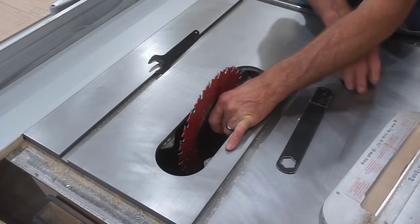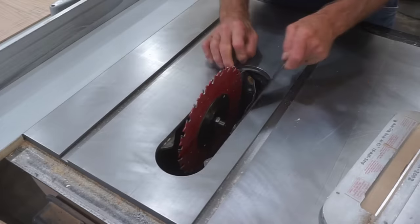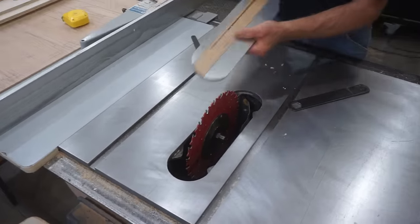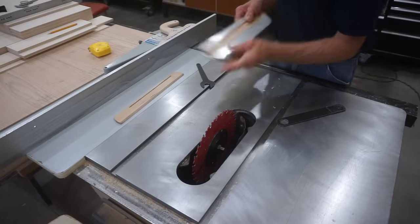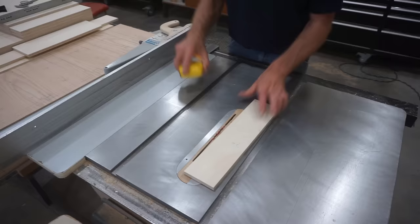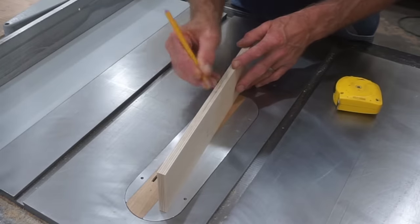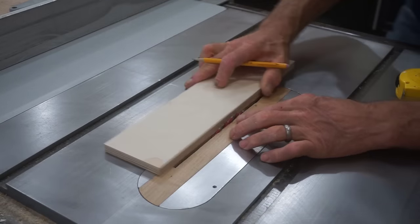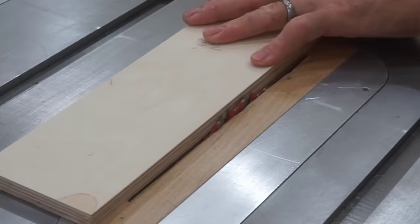I get to talking and forget my washer. And I'll switch out the insert for this wider blade. I made extra drawer parts for setup operations like this, and I want the dado to be 1/4-inch deep. And you can get all kinds of fancy gauges for setting blade depth. Personally, this is tough to beat.